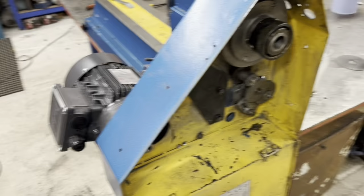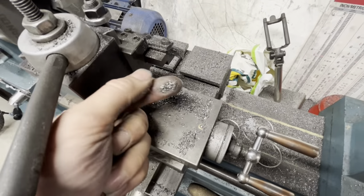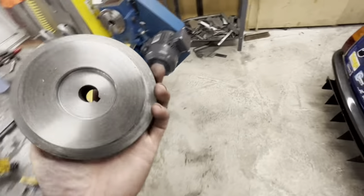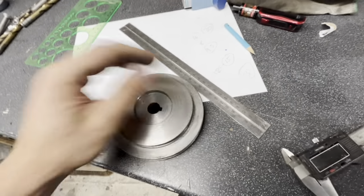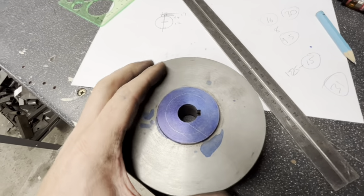So now we've got the motor on. What we are trying to do is make a pulley. This is the original one and we've machined the back off and machined the front off — we've made a right mess of the lathe, it's cast iron everywhere. We've opened this up and done some maths. What we need to do — because I don't have a broach — is: you see my line, that is 9.5 mil. I've got to drill an 8 mil hole on that line, then bore this out to 24 mil, and machine the sides down.